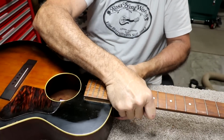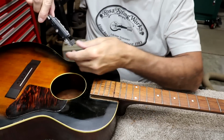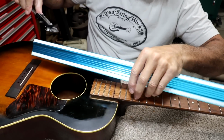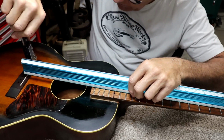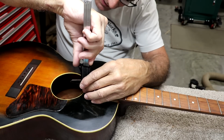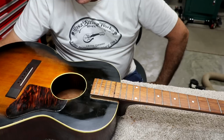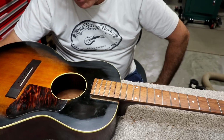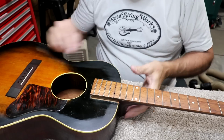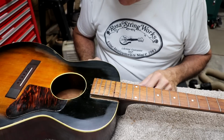Probably a hair less than a half of an inch. So let's just measure again and see if we can get a good ballpark measurement here. Now we'll just go ahead and measure over the 253, it says, and then 190 is about what I'm getting here. So 253 and 190. The difference is what? I shouldn't do math on camera. So it's about 63 thousandths. That's right at a 16th of an inch. So we're really on scale for being perfect.